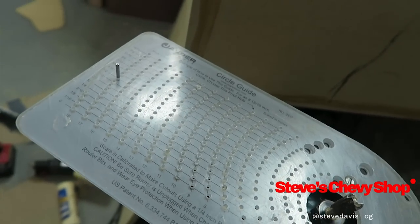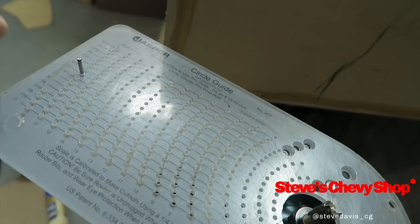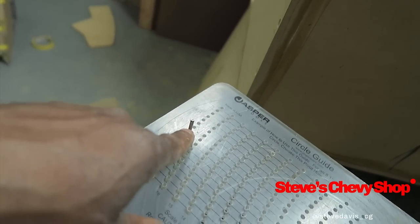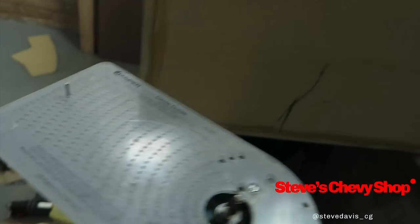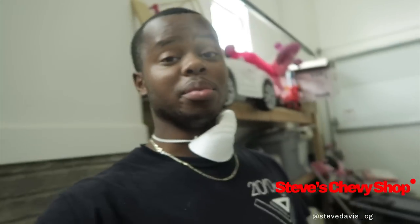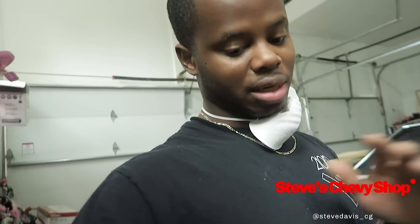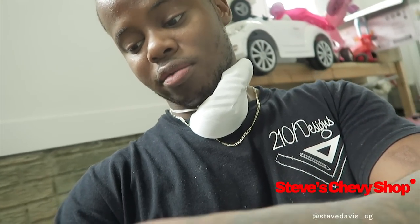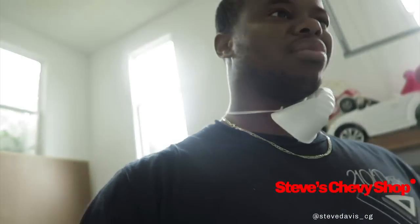All speakers come with different size cutouts — eight inch, six-and-a-half, they all have different sizes. I'll get my drill, do a little pre-drill hole, put this in there, set whatever size I want, and boom — I'll be there. No more jigsaw. I used to use a jigsaw — I know a lot of people might laugh at that. Everybody when they first start making boxes cuts their circle with a jigsaw. It's okay, but I don't do that anymore — trying to be as proficient and clean as possible, very professional. That's how I've been doing it for the last three years.